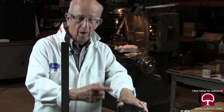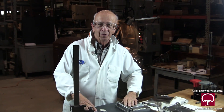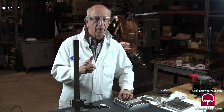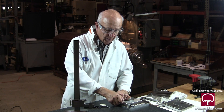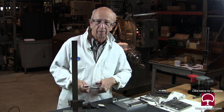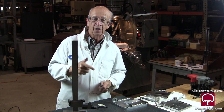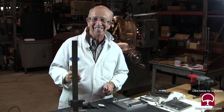So the guys did a good job squaring this up, because if it weren't square, we wouldn't have the ability to get everything lined up. So it's all cool. Now we're going to do one more test — we're going to get a shaft and fit it all the way through, because this is just checking each end. We're going to get that shaft here in a minute and try that. And if it slips in, we are good to go, baby. Sweet.